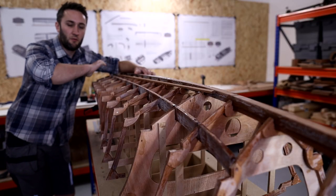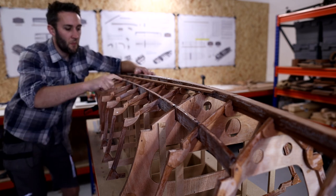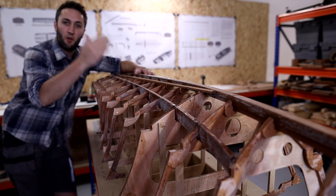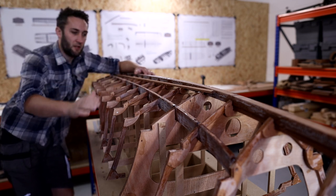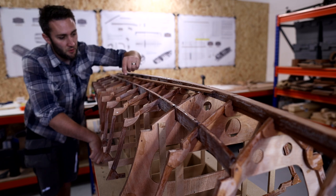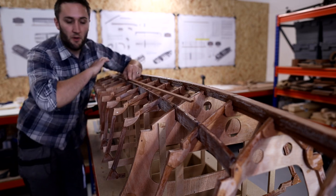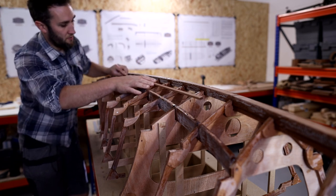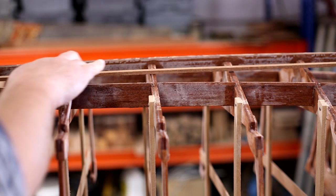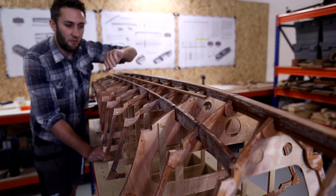The idea here is to begin to bring down the bottom of the boat so that we can start to lay some planking and it's going to make good contact with all the surfaces it needs to make contact with. These stringers are closed off when the bottom of the boat goes on - we've got a beam here that we've cut through when we notched the frames into it, but when we put the bottom plank back on the boat that's going to close that beam back off again, making it a really strong construction. We won't actually lose any strength with what we've currently cut out of this lamination.